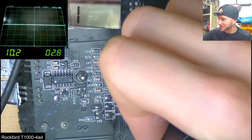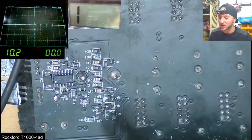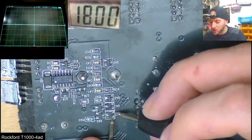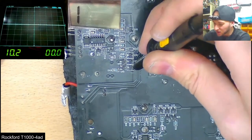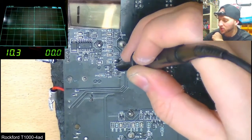There's a nice looking PWM, but it's not making its way through this little circuit here of transistors and probably some resistors — it's not making its way to our drive IC. I then started following the pulses through the set of transistors that were between the daughter board and the drive chip to see where they went missing. We go into Q41 next to it, and we don't come out.